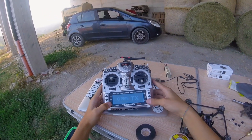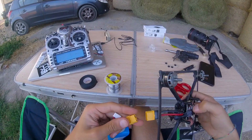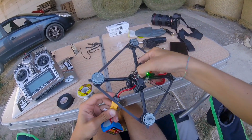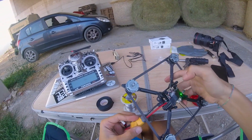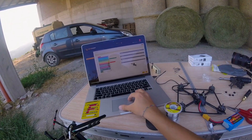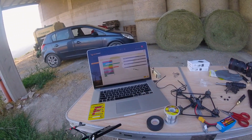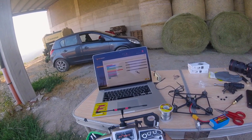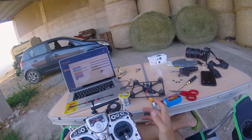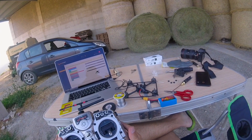Here I have Frsky. I'm going to turn it on and bind. I press bind, I press and hold this button, and then I turn on the quad — two lights should pop up, then that light should turn off. There you go, done. Receiver — now I have to set the channel order to TAER, then save it and it's fine. To check the quad is working, you always just do left and right stick inputs — if the quad responds correctly, it's fine. Left and right, left and right — done.